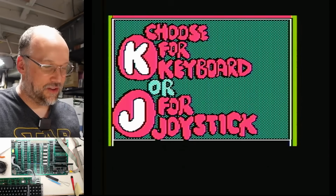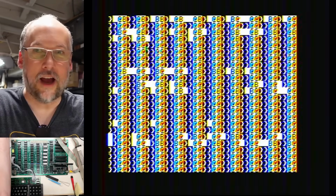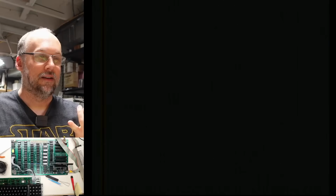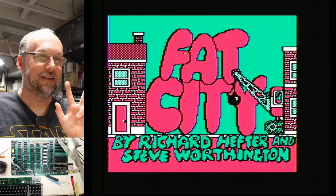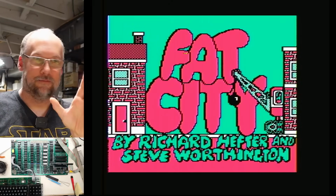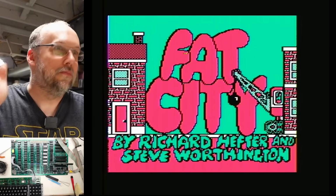Okay, so one of the things I'm noticing, let's power cycle that again. That title screen there should have had 6 colors on it. And we weren't seeing 6 colors. We were only seeing, well, black, white, and then the green and the pinkish color. So we're missing colors there, so that's a problem.